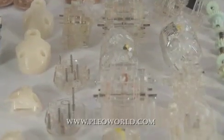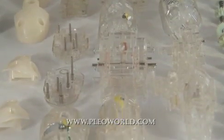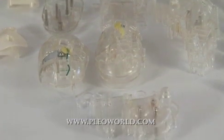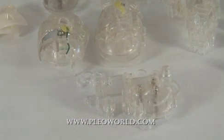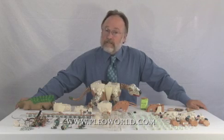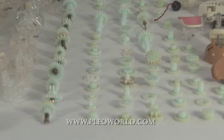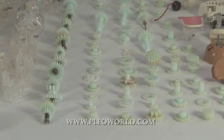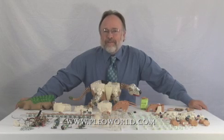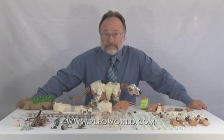Here we have the gear assembly boxes. These gear assembly boxes were designed to allow very precise spacing between the gears. This precision spacing allows us to get by with smaller gears, to make less noise, and to provide efficiency also. Here you can see we have 108 gears that run Pleo. Now, I counted them, there's only 106. I lost 2. That is another good reason never to disassemble your own Pleo.